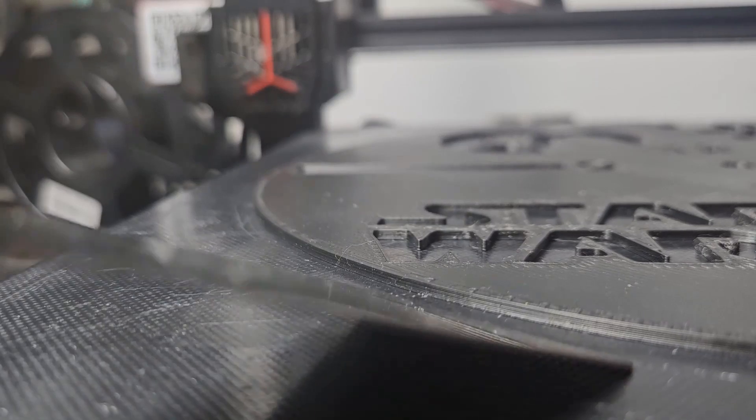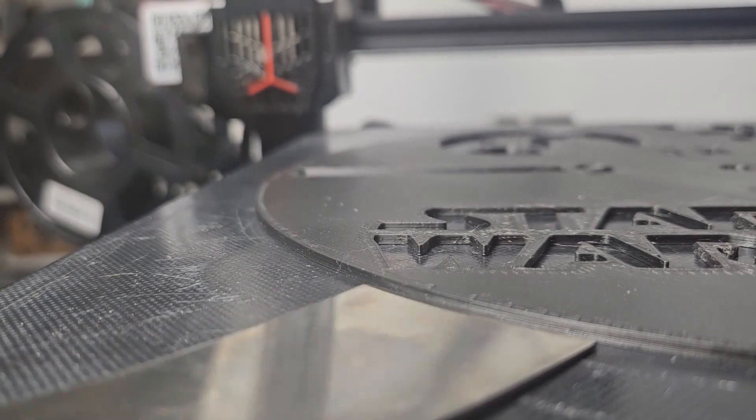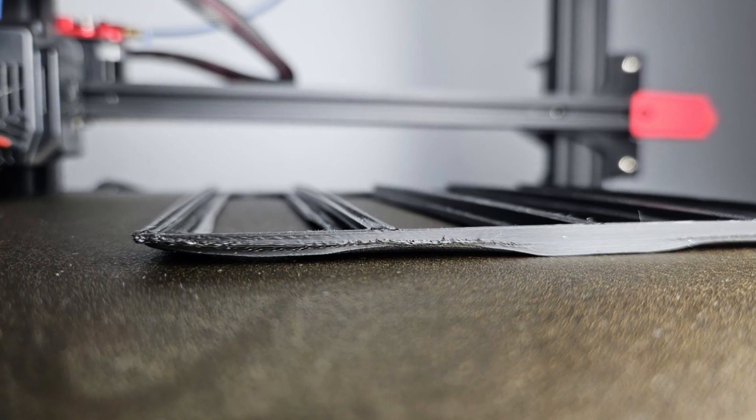Now I know everyone's experience is different when it comes to 3D printing. For me the magnetic build plate caused a whole new problem. The main reason I upgraded was because there was too much adhesion when removing prints from the glass. With the new build plate I was having the opposite problem — the filament was not sticking during the print. This was causing warping and sometimes the prints were failing completely.